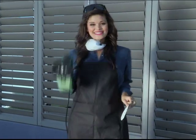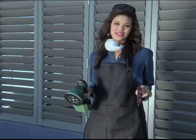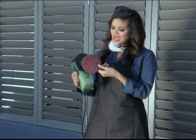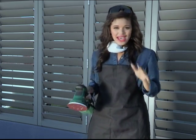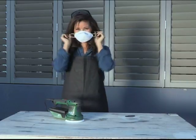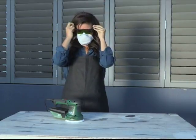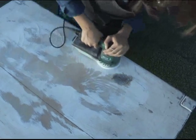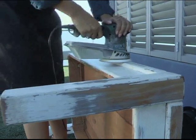The first thing we'll need to do is sand down our wooden table to make sure it gets down to its original state. I'm using the 80 grit sandpaper — all we need to do is roughen up the wood to get rid of the old finish and allow the new paint to seep in. Zoe worked smarter and not harder by using a Bosch orbital sander from Builders to speed up the process.